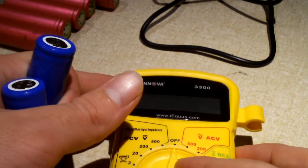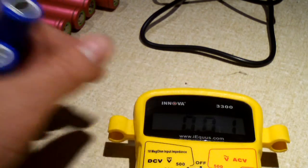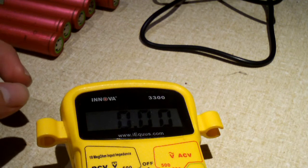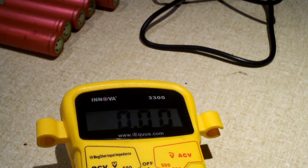Another sign these two batteries aren't in the best standing is that the measured voltage has dropped a little bit in the past 24 hours. When they were super hot last night when I pulled them off the charger, they were about 4.1 volts. I can go ahead and measure the voltage right now, and you'll see it's significantly lower. This one reads 3.81 volts, and the other is roughly 3.8 volts. So the voltage did drop slightly.